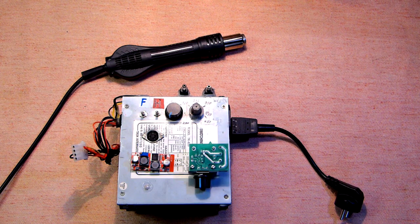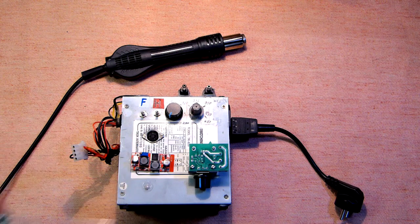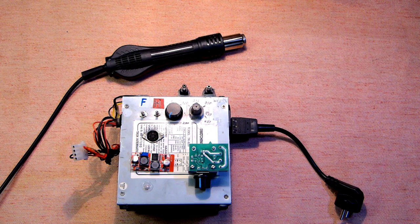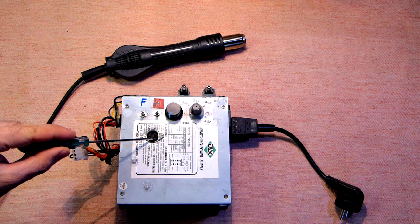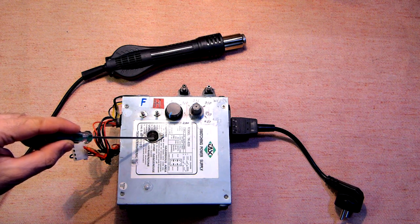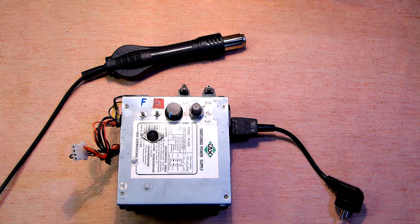Without the above-mentioned changes the voltage would be changed from approximately 50 volts to 220 volts, and this part would definitely be damaged. But now this potentiometer is for coarse adjustment and this potentiometer is for fine adjustment. In this DIN connector we have output voltages: in the middle we have grounding, on the right side we have AC, and on the left side we have DC 24 volts.